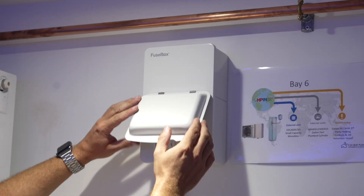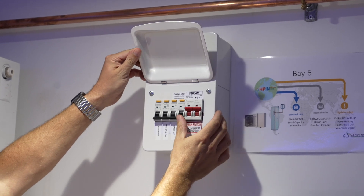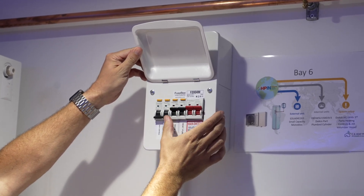We're going to start with the small consumer unit that you will be sent with your pack. The consumer unit will also come with the MCBs and RCDs required for the job. It is the electrician's responsibility to fit this and correctly size the cable required to get to the heat pump, where the rotary isolator — or isolators in some cases — must be installed within one metre of the outdoor unit. The electrician must also provide a building regulations compliance certificate and minor works certificate for that work.